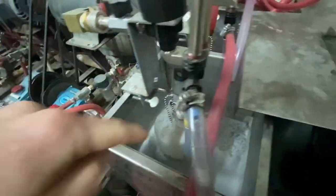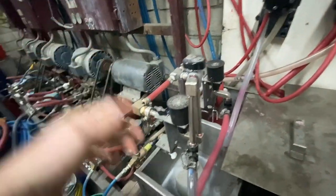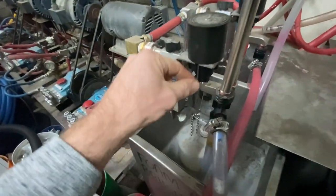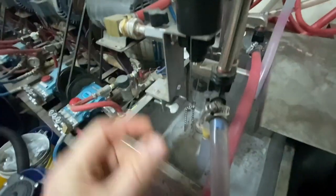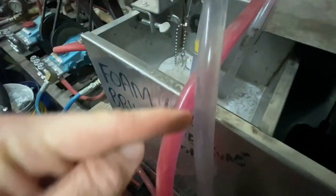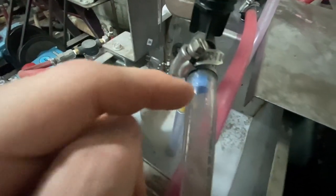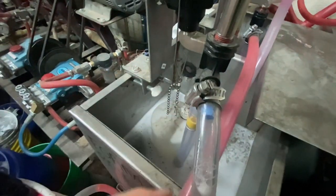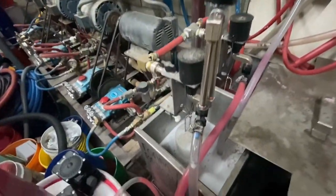We have this white weight here — you can see it just hangs there. So when this liquid gets used, it obviously goes down and down. When the soap brush is on in the bay, that gets used and goes lower and lower. Once it gets to a certain point, this weight pulls down — and you can see that the soap is getting sucked up through the tube. We have different size tips in here — about 12 different tip colors, maybe even more. They're all different sizes, so it depends on what tip size you have, the liquid, and the air. That's how thick and how much soap determines how much is going to come out.